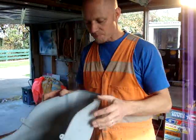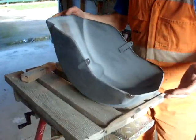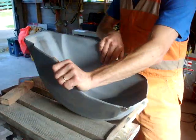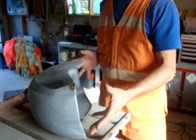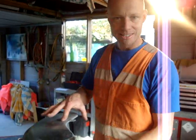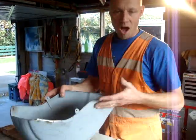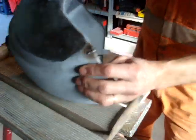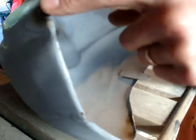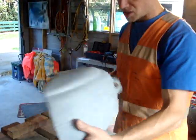What you do to start with is you get the shape of the guard right first. It could be anything — a mudguard, a door, a roofskin you've unpicked. So you get this into the right shape. Wherever it's buckled or collapsed in, you push or dress or off-dolly that out so you've got your original shape right first. No point repairing a dent if the edges are all pushed out. So rule number one: align your edges. Next, you go through and weld — with a MIG, TIG, or gas, whatever your fetish is — and you weld up all your cracks. Because where it's cracked is where the panel's gonna flex.